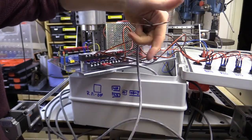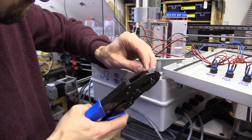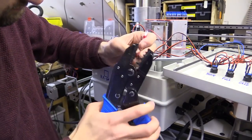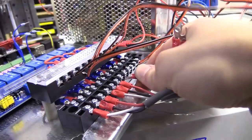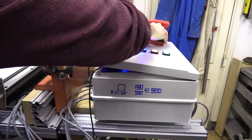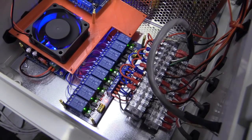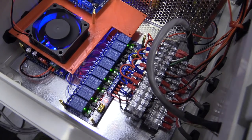I wanted to get this thing moving and hopefully it doesn't make future work to the electrical box too fiddly. Using glands helps reduce breaking the shielding or screening around the core wires, but it also prevents dismantling the machine from the controller. I checked the limit proximity sensors work correctly, looking out for the LED turning on and the relay module switching when the sensor comes into contact with metal — a precision screwdriver in this case.